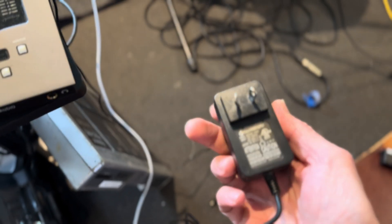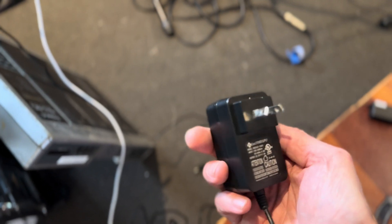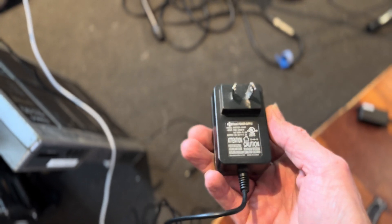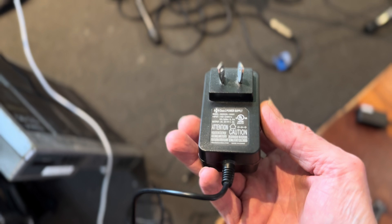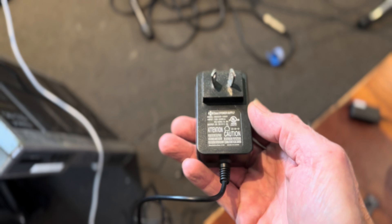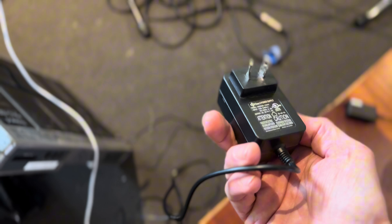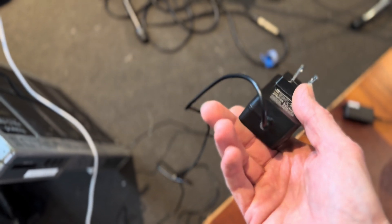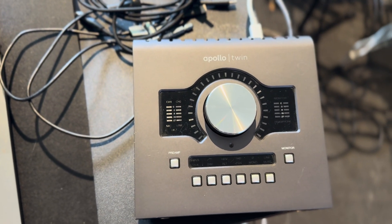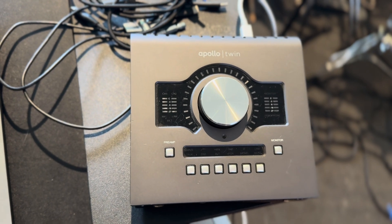It's a US adapter, so to test what it was actually outputting I just bent the pins and it goes straight into an Australian wall socket. Before you do that you have to check that it says on the back that it can work between 110 volts and 240 so you won't blow it up. So I did that, just bent the pins — it goes straight into an Australian socket. I measured it and it's 25.2 volts. So I'd say they've plugged that in, gotten confused with their power adapters, and blown it up. So we're going to open it up and see what's gone wrong.